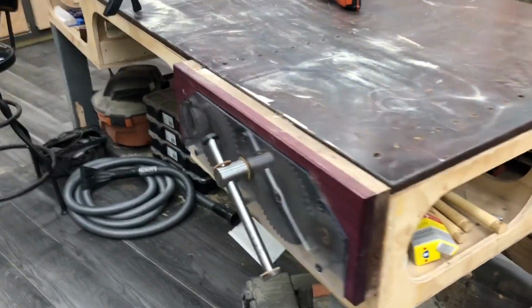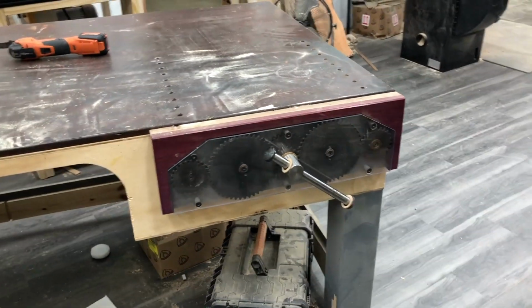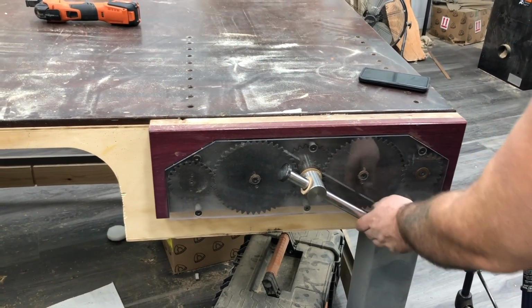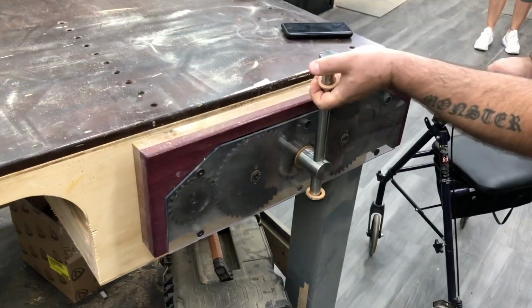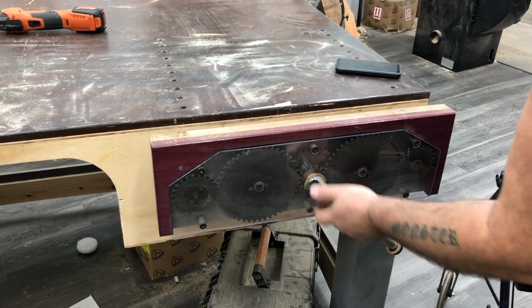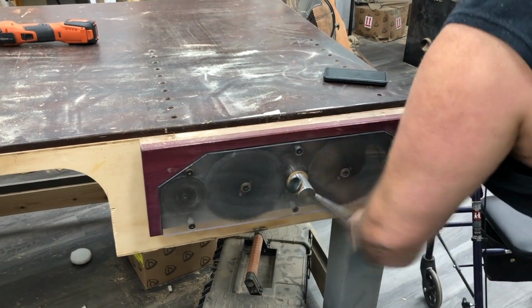And here's your vise. That's the Andy Klein vise, baby. Andy Klein vise. How does that work? So it's dual speed. It's called the twin turbo vise. When it's engaged, when it's pushed in and engaged, it's in high speed. When it's pulled out, it goes in low speed. And obviously you have more torque in low speed than you would in high speed.